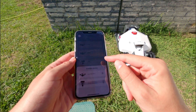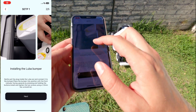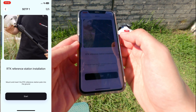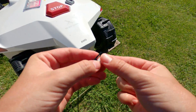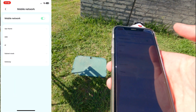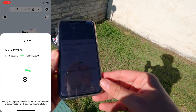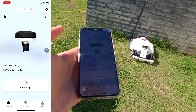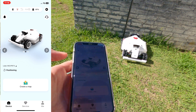The pairing process was easy but a bit confusing, since I had the possibility to pair both the RTK antenna and the robot, but it wasn't explained if it was mandatory or why. I thought it might allow connecting multiple antennas to extend range, which would have been a great feature, but apparently that's not the case. Connectivity-wise, I tested both the SIM card and the Wi-Fi approach. The SIM card didn't work at first, so I had to connect the robot to my phone's hotspot. After downloading mandatory updates, my SIM card was finally detected with working 4G coverage. I also noticed the robot keeps disconnecting from the app — you have to press reconnect often two or three times in a row for a stable connection, even when the robot has an excellent network connection.